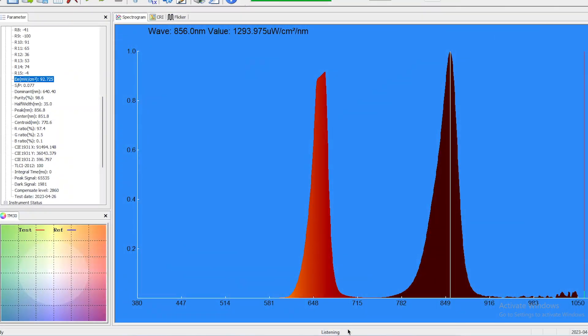When I plug in my spectrometer, you can see there are two big peaks. The red light peak is quite wide — a flat top ranging from 653 nanometers through to 665 nanometers. Then we see a near infrared peak around 856 nanometers. However, that's it. You're only getting your 660-ish in red and your 850-ish in near infrared. There's no 630, no 810, no 830. These other wavelengths are pretty much commonplace now, so though we're seeing a nice wide range in the 660 nanometers, it's still lacking compared to some other panels.